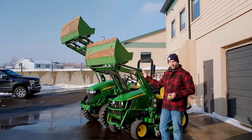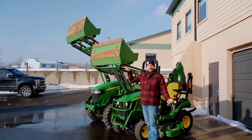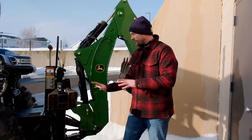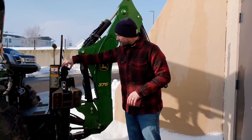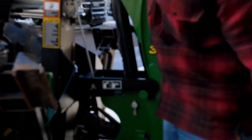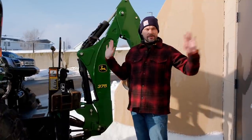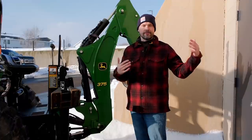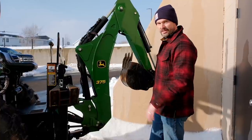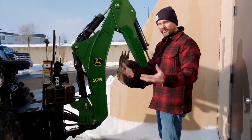These aren't really moving that much in just an hour. However, if you multiply even a half inch or an inch over 24 hours, you're talking potentially 24 inches — it can really add up. Backhoes pretty much always come with some sort of a restraint — a big bracket or a rod you put through — because they are known to leak down. This isn't just John Deere; it's backhoes in general. If you have one parked tight to the wall in your garage with a car behind it, you could come out a day or two later and find it's drifted down and punched a hole in your wall or put a dent in your car hood. Something to keep in mind — whether it's a loader, a backhoe, or even a mower deck, things are going to drift down over time.